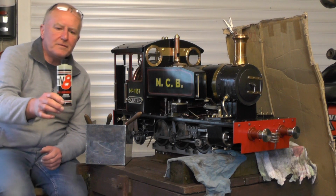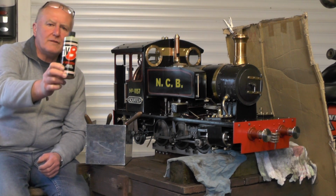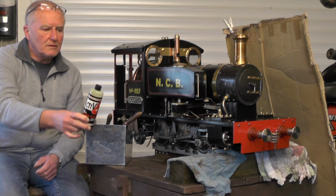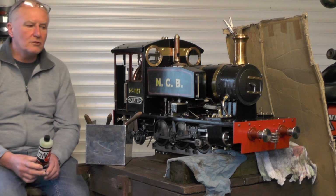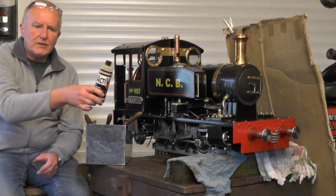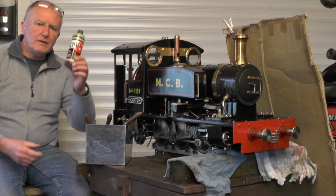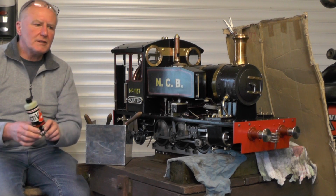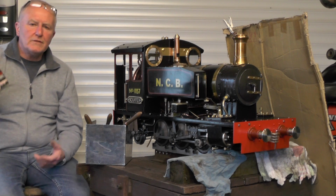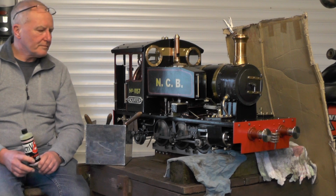Hey up everybody. Well, Activate, I think it's done the trick. My friend John swears by this Activate, and in this instance, I think it's done a good job. What I've done, I've flooded the cylinders and all the moving parts, got it running on air, and let this Activate circulate the system. Steamed it up as you've just seen, and it went more or less straight away.